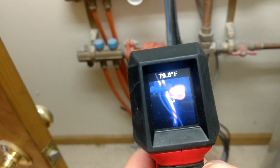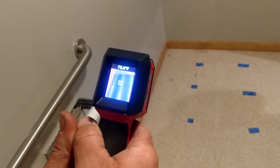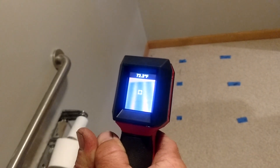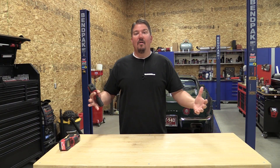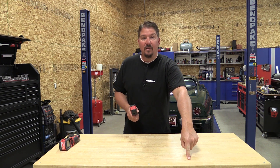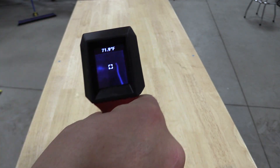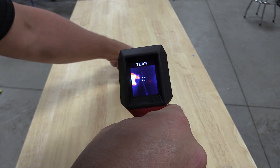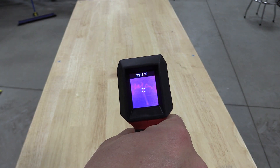The only downside to this unit is it doesn't have a laser. When we were pointing it at the floor trying to find where the in-floor heat lines were, you have a little center dot that tells you the temperature and where it's pointing in the middle, but we couldn't figure that out precisely. Once someone walked into the picture, it took away all the temperature differentiations because they were so narrow. So what we had to do is run our finger across the floor — that little friction of heat would show up in the thermal imager — and we'd say 'okay, move over an inch or two.' We taped it all out so he could drill his hole for a shower.